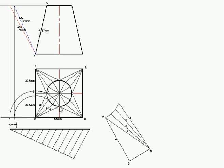Now I've drawn D, which we know is 74. Set my compass on that point C, from point C to point D. Made myself a 74 arc. I've put my compass there, opened it at 9, made myself a mark, and I've drawn that little triangle with D.